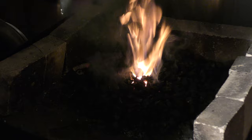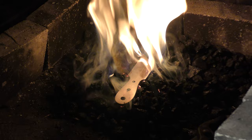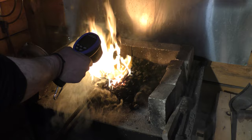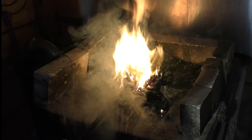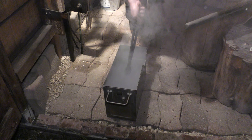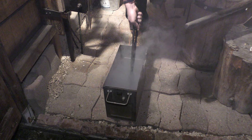According to the manufacturer, XC75 needs to be quenched at 800 degrees Celsius. I'm cleaning the scales pretty often and checking the temperature with my infrared thermometer. I'm maintaining this temperature for a couple of minutes, then I can quench in oil. Sounds like a successful quench.